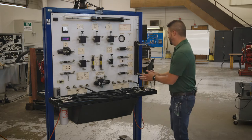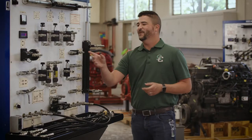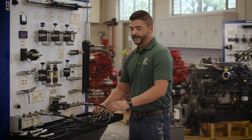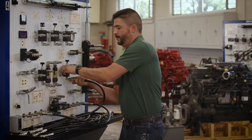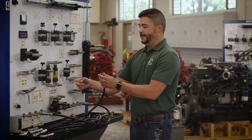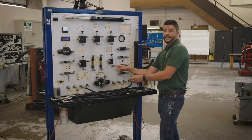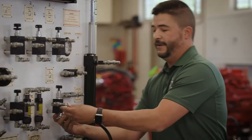As you are working on these, I always have a rag present because you're going to get a lot of oil on you. Each one of these connections here is called a quick coupler — they're made to couple quickly, just like it sounds. When we put these on here you should hear them click in. If you don't put the hose all the way on it will not have a connection and the oil will not be able to flow through the hose or the fitting itself.